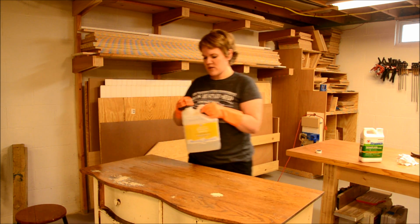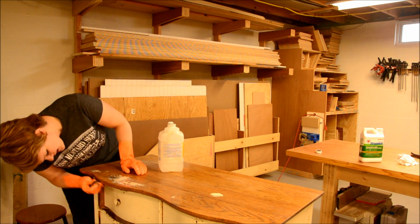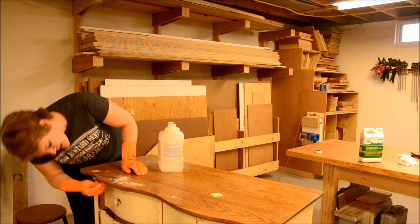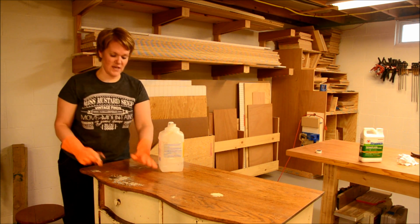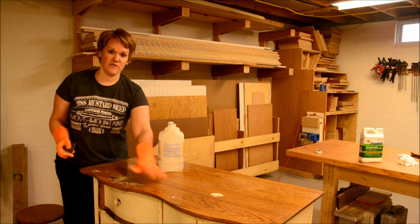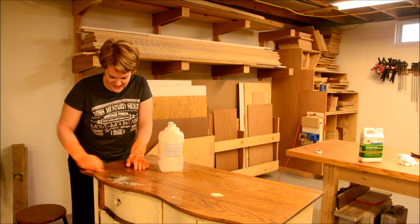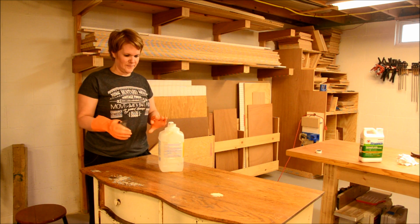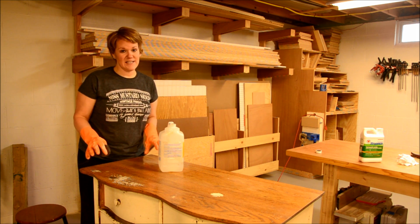And it's also going to help me with getting around these corners a little bit better than I could get with the putty knife. And so I'm going to make sure that I have the underside of this nice and scrubbed, and I want to wipe down the piece as well with some mineral spirits anywhere where the chemical stripper may have dripped, so that when I'm painting it, I don't end up with a patch of some of the chemical stripper that's sitting on the surface, because of course the paint won't stick there, which is sort of a cool effect actually if you're doing it intentionally, but not if it's on accident. So I'm just going to get this all totally cleaned up with the steel wool and some mineral spirits. I'm going to let it dry, and then I'm ready to sand.